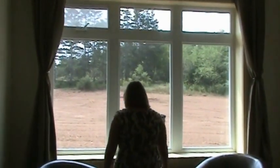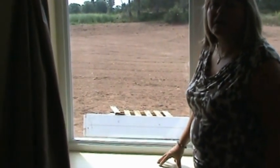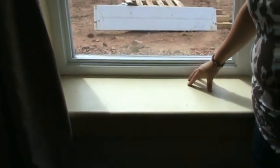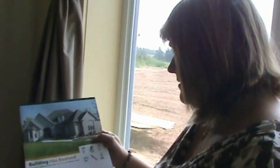You'll see the south facing window is the key feature in the master bedroom. You'll also notice that all the house has really thick walls and ledges — about 12 inches. There's 4 inches of insulation, 4 inches of concrete, and then another 4 inches of insulation on the outside. We put gyprock on the inside and regular siding on the outside. Nudura is the product we used, and our builder has been doing insulated concrete forms for 30 years. That in part is what's keeping our house nice and cool. If you're interested, there's Nudura.com to check it out.